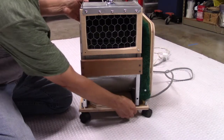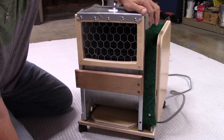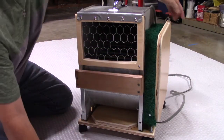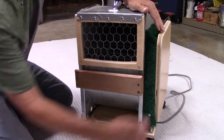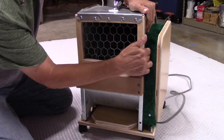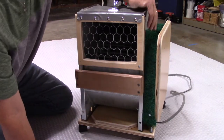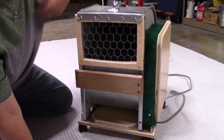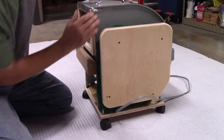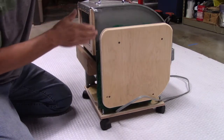On this edge, I had the problem where part of the motor came out, so what I did is I put large blocks of wood in the four corners of this piece of wood, drilled a hole right through, through the blocks of wood, and into the sheet metal. I attached the blocks down first, and then attached this piece of wood to the blocks. After doing that, I put chicken wire around it, and since dust would go through there too, I put some more filter material and made this handsome-looking side part that protects the motor yet lets ventilation go through the side.